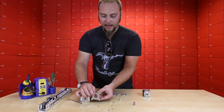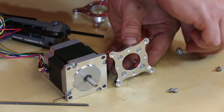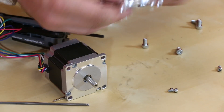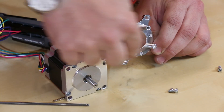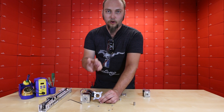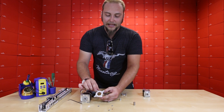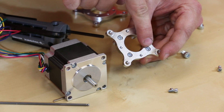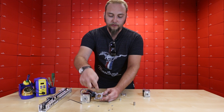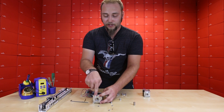It's really as easy as that. The bracket just fits directly on the front of the stepper motor, and then you use the included screws to bolt through the back of the stepper motor into the mount. The mount has the Actobotics screw pattern on the front of it — this is the screw pattern that fits the outside holes on the Actobotics pattern.